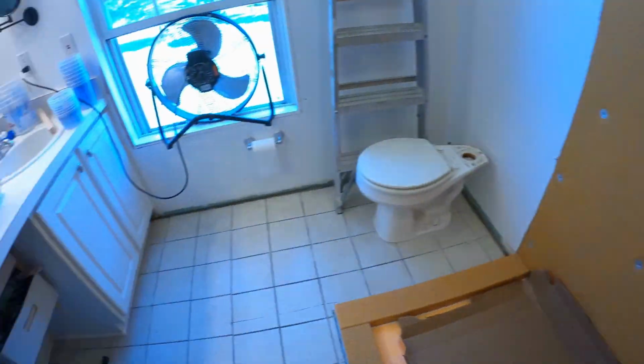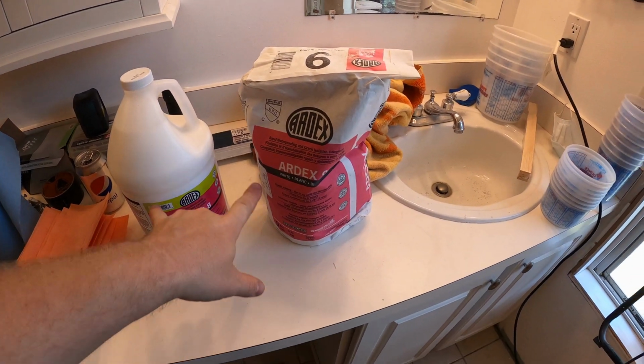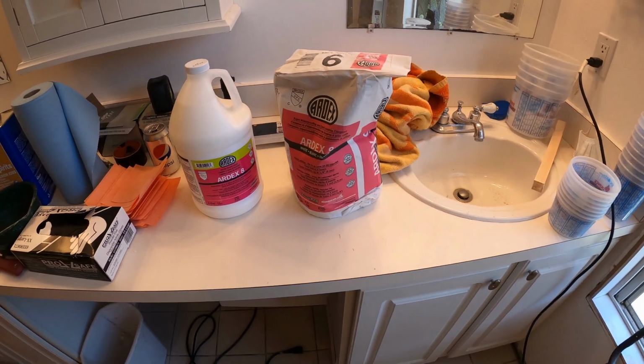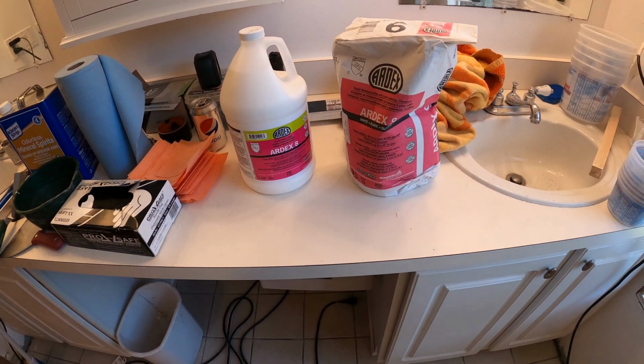And so for mixing, right, there are 2 mixes. There's paintable and caulkable. The paintable mix is a 1-to-1. It's just by volume, right? Whole bag of this, whole bag of that. That's what they say on their tech sheet. And then for caulkable, they say whole bag of this and like 2/3 of this. They don't use measurements. They're really bad at that.